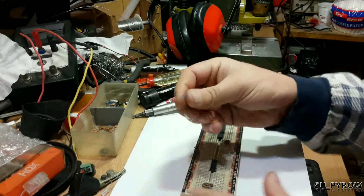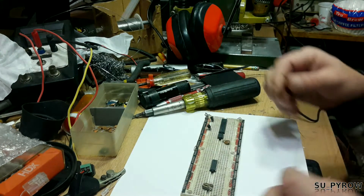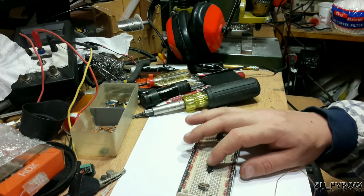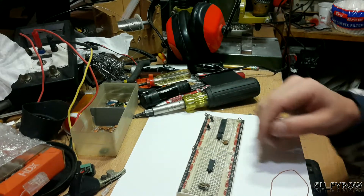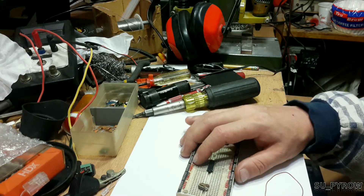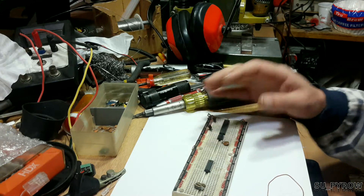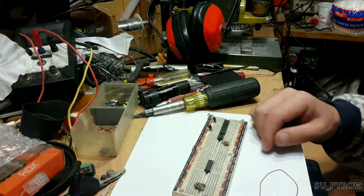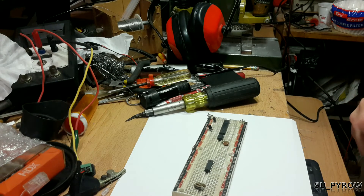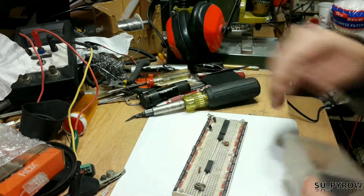The first thing you need is a wire and a 1k resistor. You don't want to go past five volts — you want a nice stable regulated five volts. If you're using a power supply, make sure it's clean. If you have an oscilloscope, verify that. You can put a 104 capacitor — 100 nanofarad — across the power rail. A 103 will work just fine too.